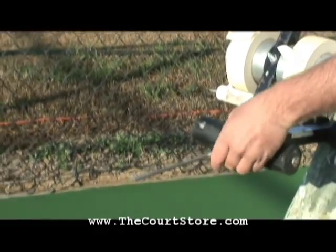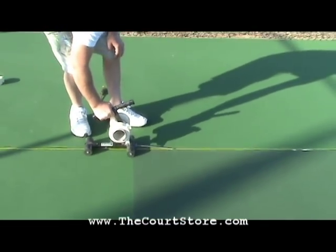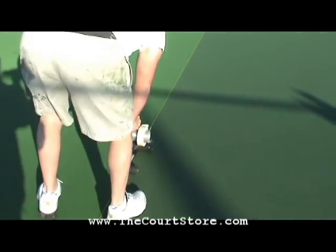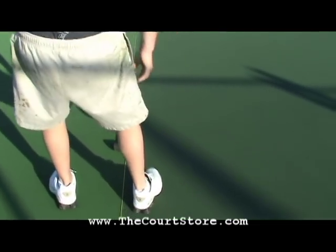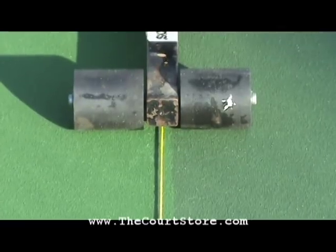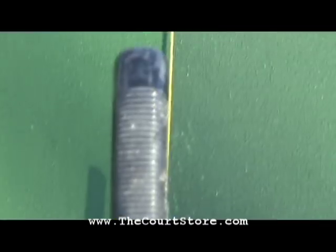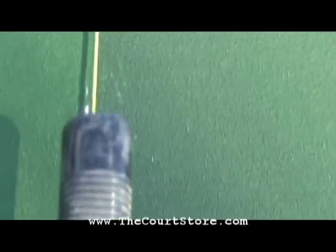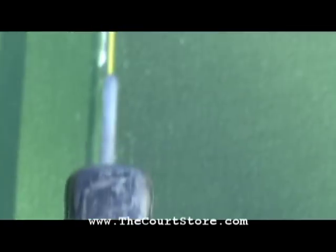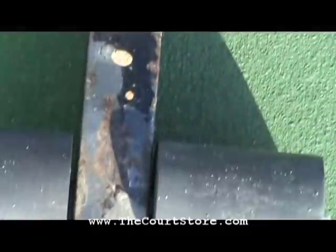When your tape is ready, it's time to set up your machine. You want to keep the pointer — that you see in this picture — in perfect alignment with the back of the machine. That'll ensure that your tape rides right in between the strings, so you'll have an inch on either side of the string open to paint. The string should be right in the center at the back of the machine, with the pointer right on the line. If it's not exactly where you want it, adjust the pointer a little bit and push the machine forward again to get the back end in direct alignment — string exactly down the middle and right on the pointer — and then you know you're ready to tape.